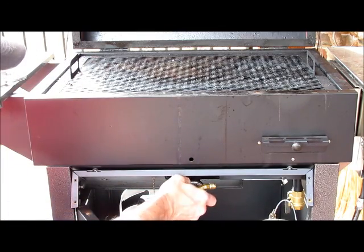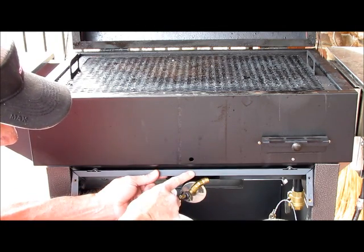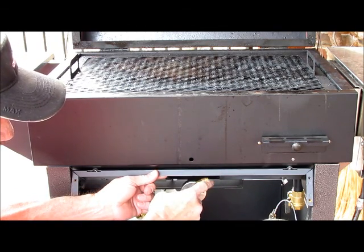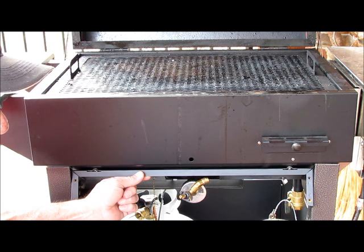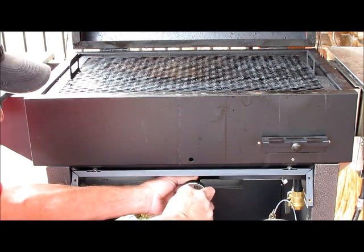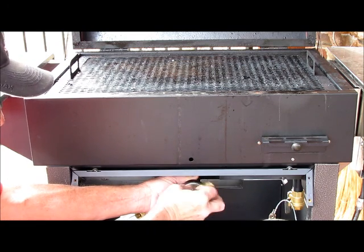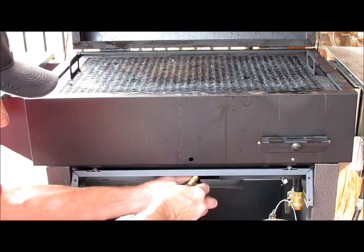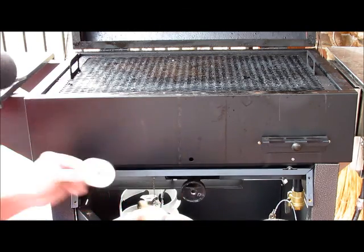One little tip here: this metal flange may come in contact with the threads of your gas valve — you don't want that. It could damage them and cause a potential leak. So a little tip is to pull down on the burner gently while you're unscrewing your gas valve out. Just keep taking it all the way out. Your air shutter and your bug screen are going to come off with it.